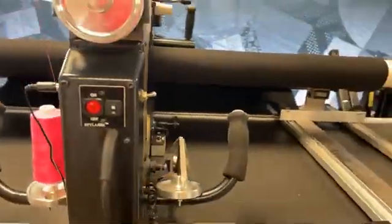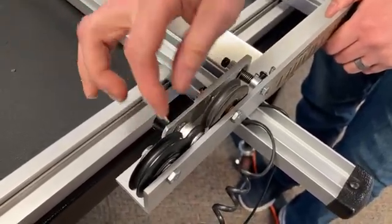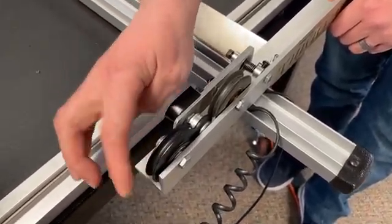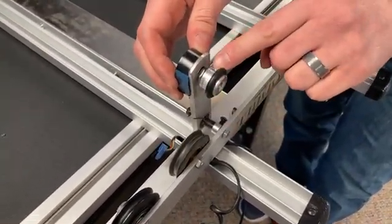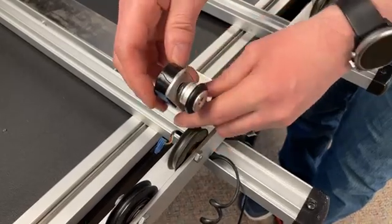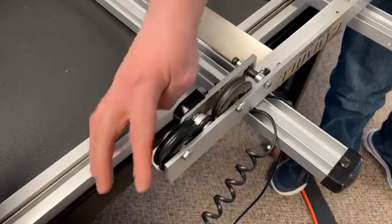On the old style tracking it's set up a little differently. You can see how this encoder pops in between the wheels — that's how it's set in there, and it actually rolls up against this wheel. When this wheel turns, it turns the encoder. If you're turning this wheel and it's not turning your encoder, you'll need to take the encoder out, remove the silver wheel with that 5/64 Allen wrench, loosen the nut in there, push your encoder forward, tighten the nut, put your wheel back on, and pop it down in there. It should be all right.